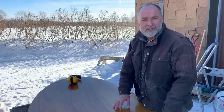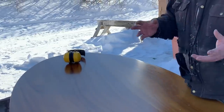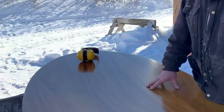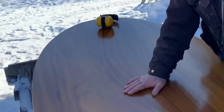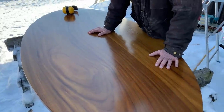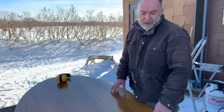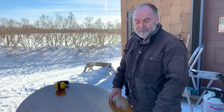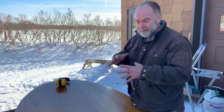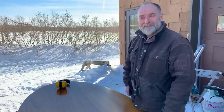The thing about a tabletop is that the surface is so prominent. If there are any bubbles, brush strokes, or whatever, that's going to be an issue. Another challenge is that when you finish a tabletop with a film-forming finish — which this top currently has — it eventually wears out and you can't really repair it. You need to strip back to bare wood and start again. So instead, we're going to refinish this with a repairable oil finish, so we can just rub it down by hand and put on another coat of oil. Nice-looking and repairable — that's the name of the game.